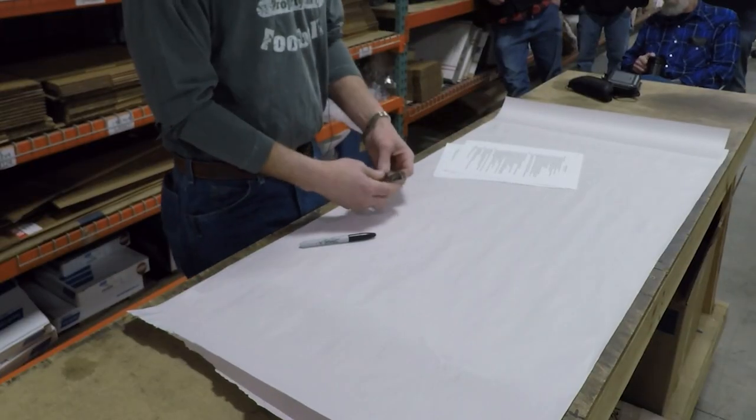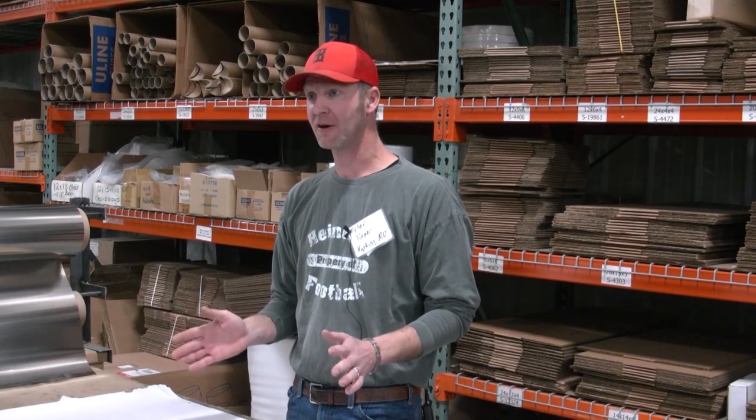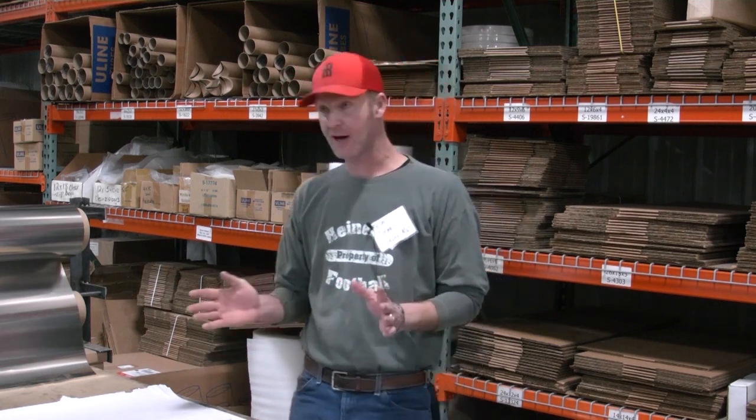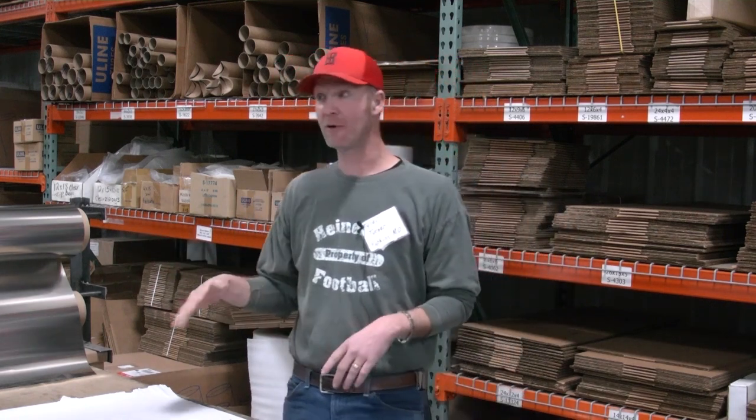What I do, you'll take the titanium, surface grind it if you can. Make sure it's flat to start with. The folders, everything has to be flat and parallel to work right. If it's not, your action is not gonna be there ever. I surface grind my titanium with a stone. The only way I can do that is I parallel it up on a magnetic chuck, just block it in with parallels, and I got my surface grinder with a VFD. You can turn that thing down to half speed and you just take a couple tenths at a time and it doesn't warp on you. If you try to get too angry with it, that stuff will curl like a banana on you. So you just gotta be real gentle with it.